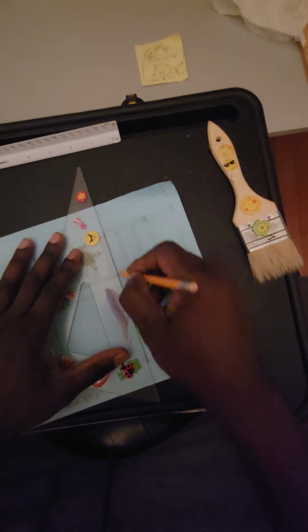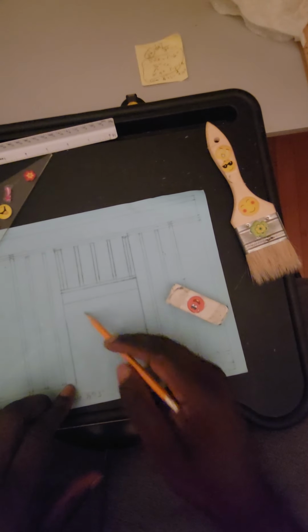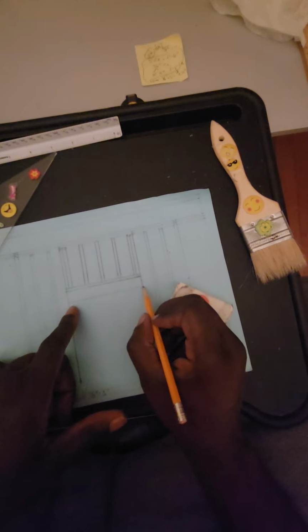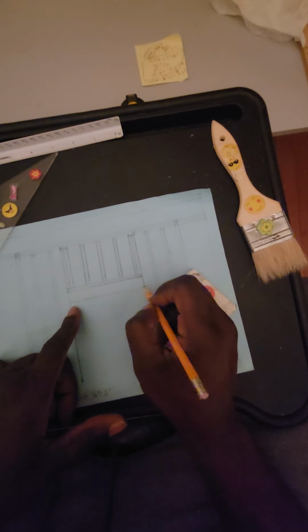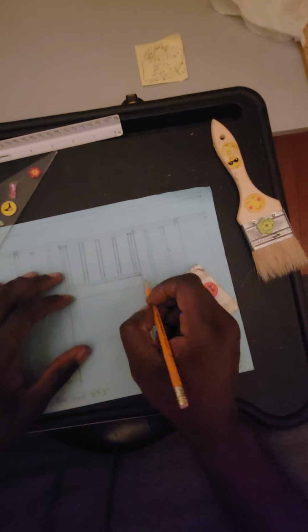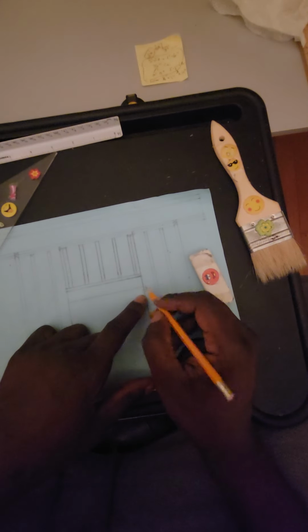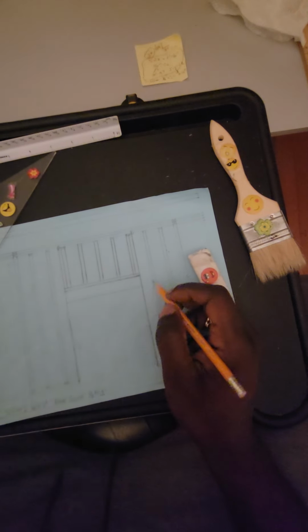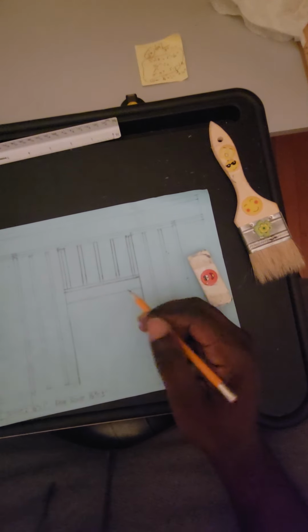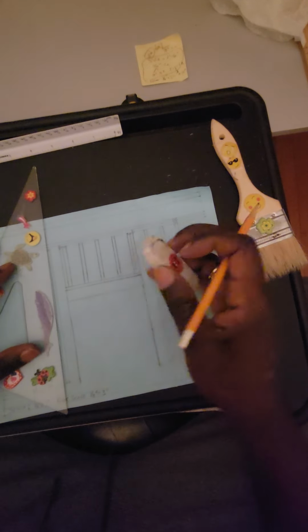Well, there's not much that happened on this, so I was just going to run back to the end. We've got to put our 2x4s and our king stud. Actually, let me just show you this. This has to extend over. Basically, we're going to extend our door opening over to catch our jack. So we've got to put our trimmer stud in there, our jack in there, and our king stud. In this case, we're going to put 2 trimmers and a king stud to help carry the load of this opening.